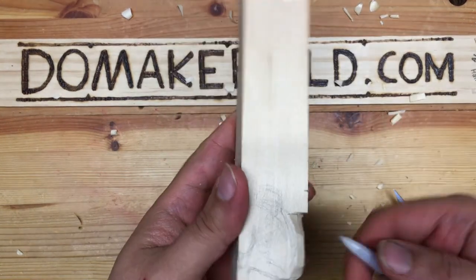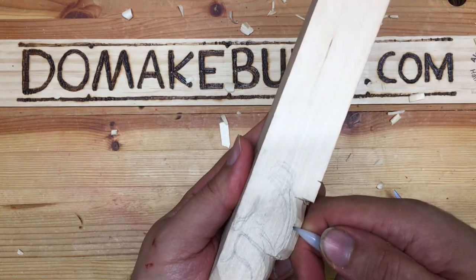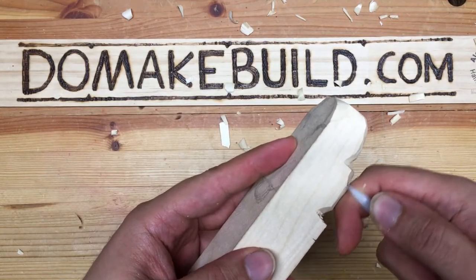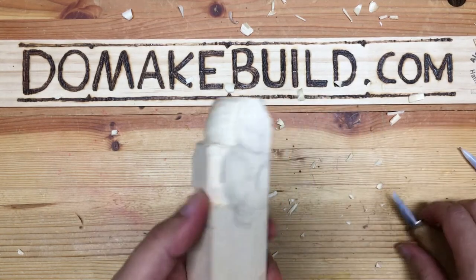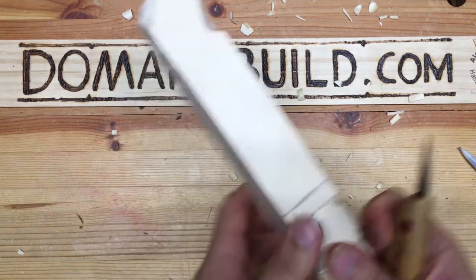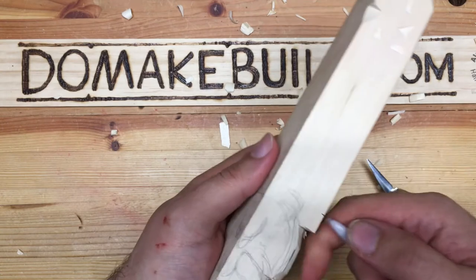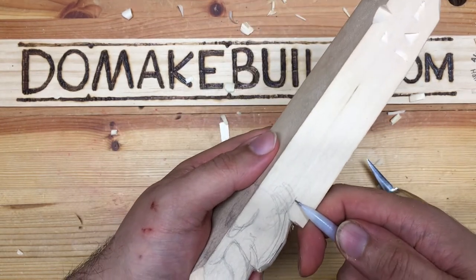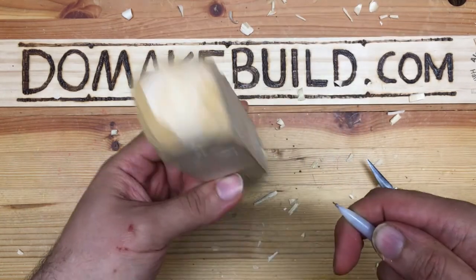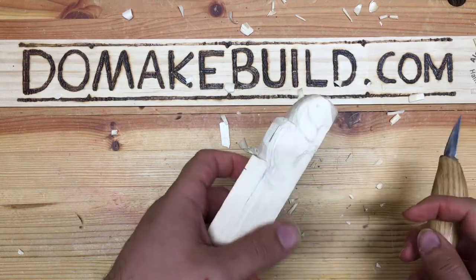Let me show you a quick little trick to get the proper height on both sides. I just use my finger as a fence and line up my pencil to where I want it, and just draw a line — same thing on this side. This is just a reference so I don't go past it on both sides. I know this is the top portion and all of this will be removed. The same can be done for the other side: this is how far down I want to go, so I take my pencil, use my finger as a fence — you see that stops my pencil from going any further — and that's the line. So I know I don't want to go below that when I'm cutting; that's my stopping point for the tail.